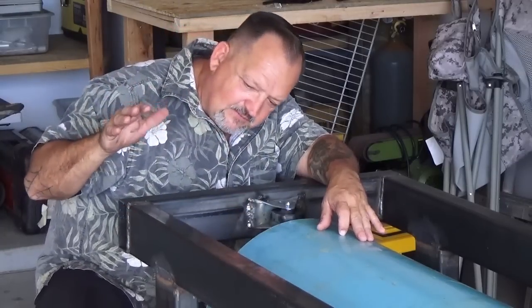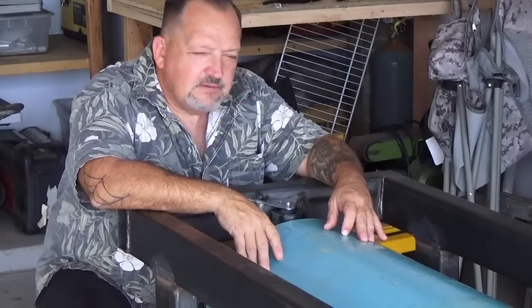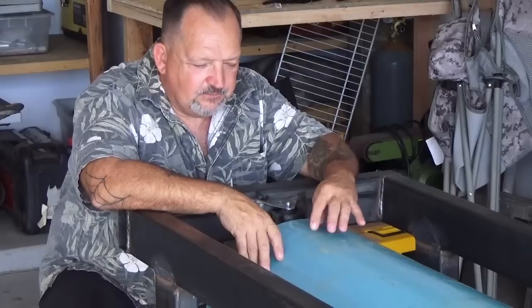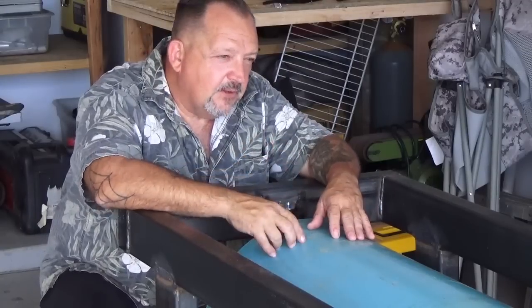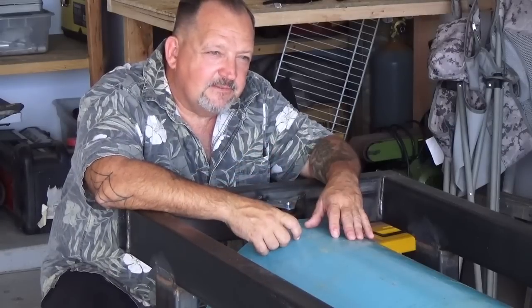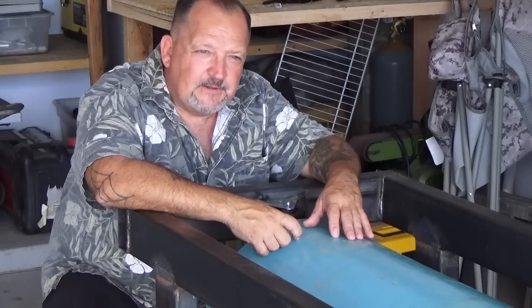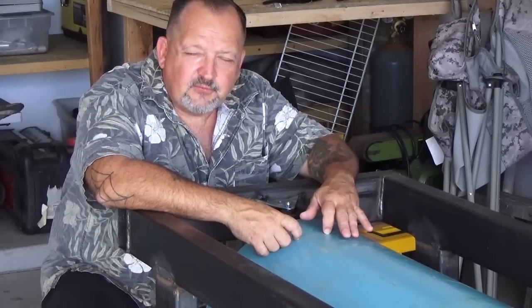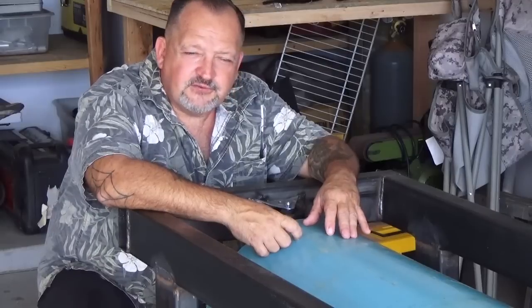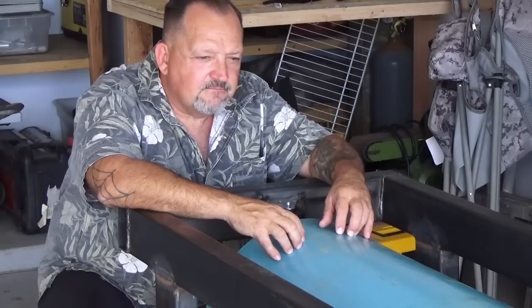I'm real proud of Alec for the welding that he did. The Evolution Rage 2, initially I was concerned because it didn't cut so well. The blade seemed to hang up. I thought the motor was spinning and the blade stopped. We found out that the blade needed to be torqued down, tightened up. So I'm thrilled to death with the performance of the Evolution Rage 2 cut-all chop saw. It cut everything here without any kind of effort.